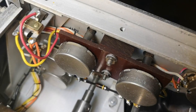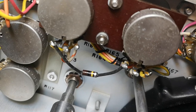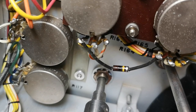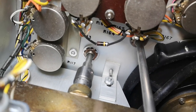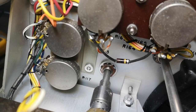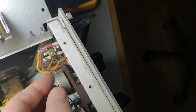I found something interesting — that is the intensity pot meter. It says 25 kilo ohms. Let me figure out the colors: white in the middle, white with an orange stripe, then yellow with black stripe. I've got it. And I actually have an idea — maybe I should just desolder those wires and put in an external pot meter and see if I can carry on, because that pot meter is just glowing red hot.